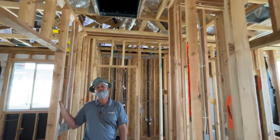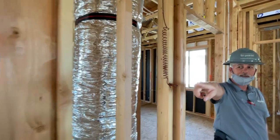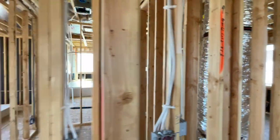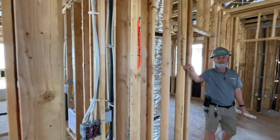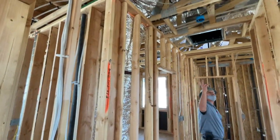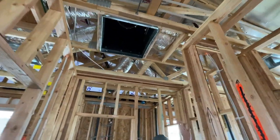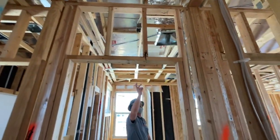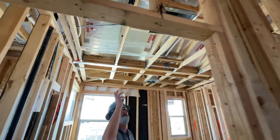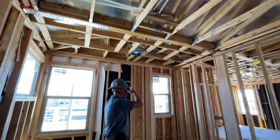Makes sense. In the hallway here, we'll have the thermostat. Like I said, it's a little different than the model. We originally had it by the front door. Found it was turning off a little bit too early for some of the kids that were sleeping down at the end of the hallway. So we moved it a little further down the hallway. Down here is a return air above your head that actually sucks air. Smoke detectors that say fire, carbon monoxide warning. In the hallways, each of the bedrooms have their own smoke detectors that are followed up with battery backups. And then again, this is your air conditioning vent that's going to ventilate the room and go out the door.